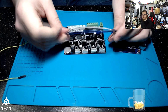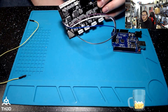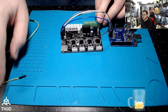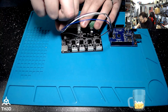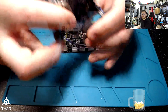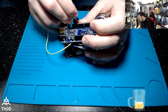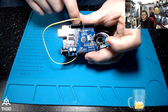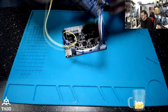The last header to connect is the reset pin — the one still not connected. The reset pin on your printer board is going to go to pin 10 on your Arduino Uno, which is why we need the male-to-female wire. Connecting the reset pin to pin 10 on the Arduino board — they're all labeled on the Arduino. Pin 10 is on the digital pins, three over from where the header separates. Now we're fully cross-connected.